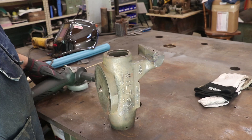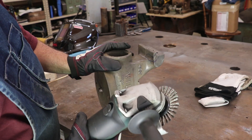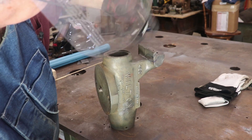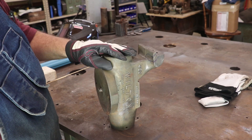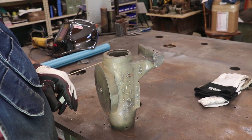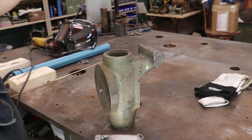Before I do anything else, we're going to come in here and just kind of clean this thing up. I've got a twisted knot wire wheel on my grinder here and we're just going to go in here. I got a little bit of what looks like some paint, but I want to get it completely clean - all the dirt, grease, grime, paint, everything off of here that I can - because impurities can get into this braze job when we start. So let's clean it up as good as we can right around the area we're going to be working in.